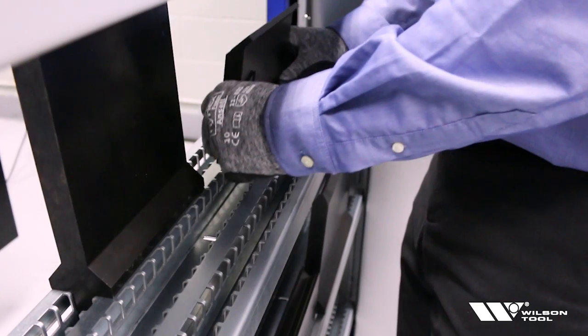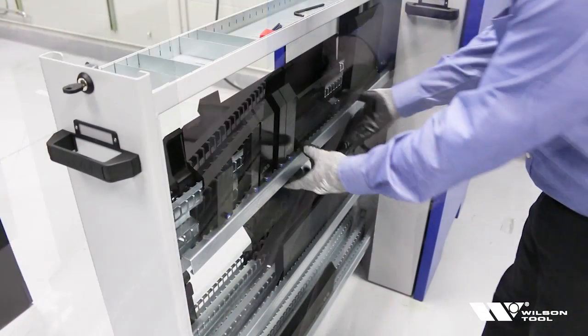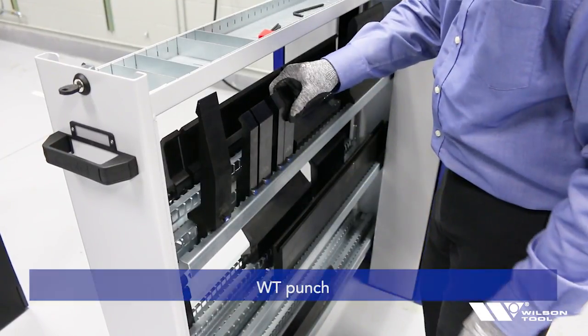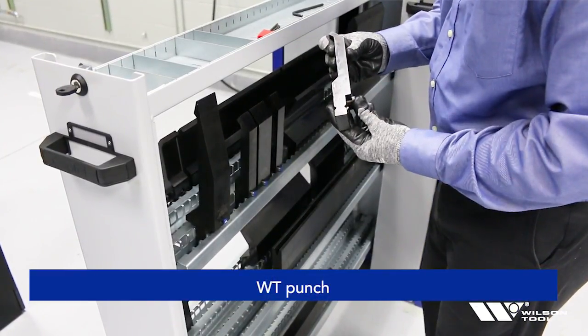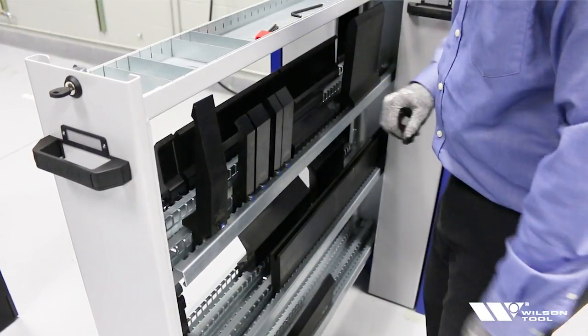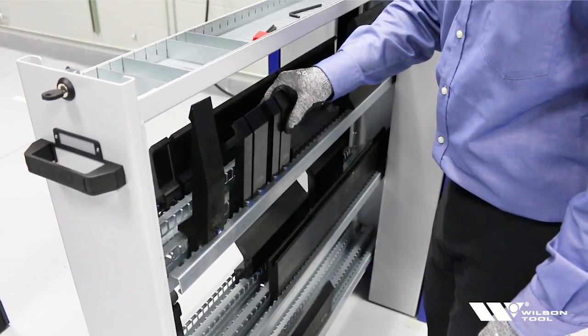Potentially if using American tooling, I might move both tracks to the middle. In this drawer the punch separators have already been adjusted for WT style punches — the 20mm tang, 787 thousandths wide — and they simply pop in. I'm not even depressing the button to put it in and out, and they're fitting nice and stable.